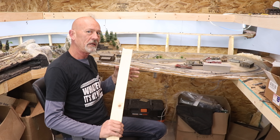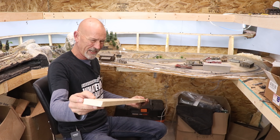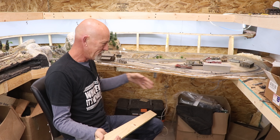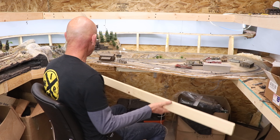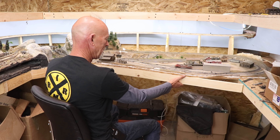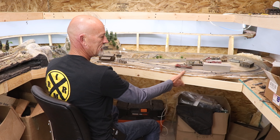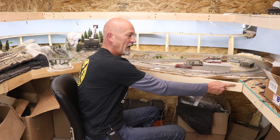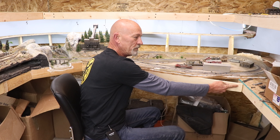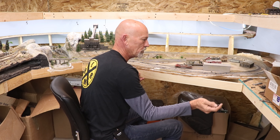I'm back with my freshly cut piece of framework. As I anticipated, I started out at four feet — 48 inches — and I kept taking a little bit more off to make it fit in this space, and ultimately beveled that piece right there. I'm going to drill a couple of pilot holes in this piece of wood because I'm going to be drilling at an angle, then set some really long drywall screws to connect that to that.